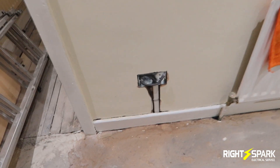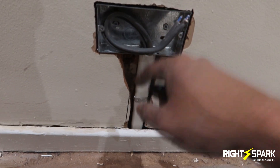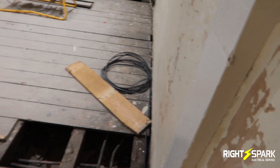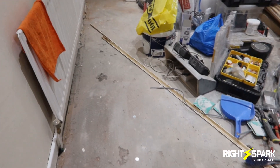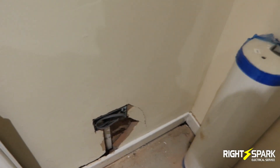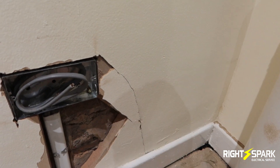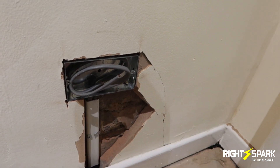This is one of the sockets I've put in. What I mean by drilling - I had to take the skirting board out and then drill into this brick wall. It's only a single wall, but I had to go into the floor, which is this floor here. On this side there's a space underneath the floor, but this is all concrete here. Because of the angle it may look quite hard fitting the cable through. While I was chasing the wall, it cracked and just came off. But anyway, that can be finished off.